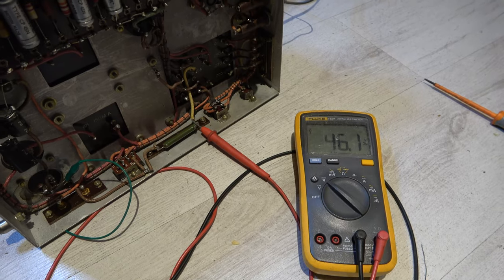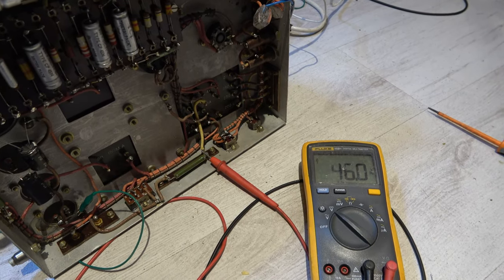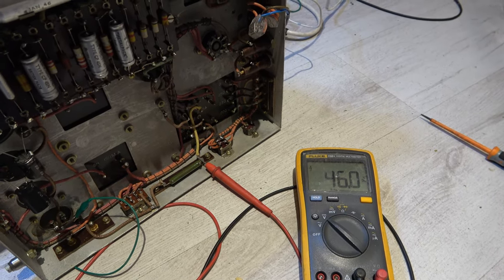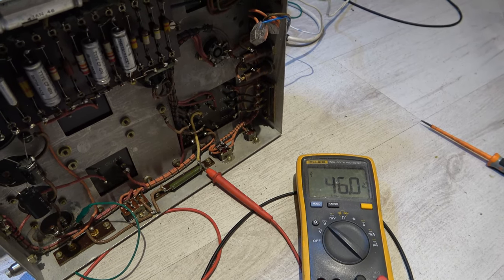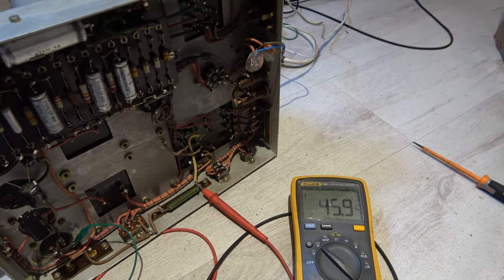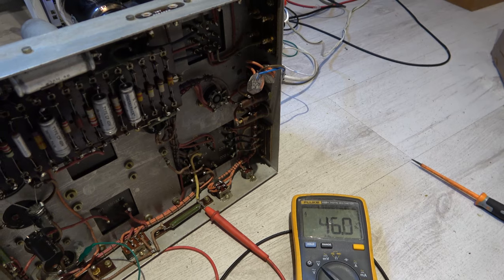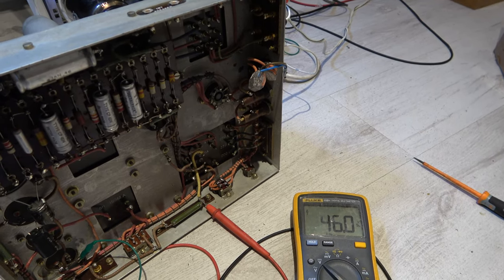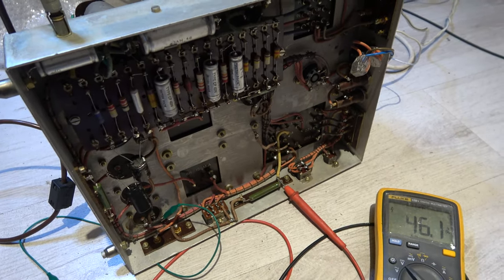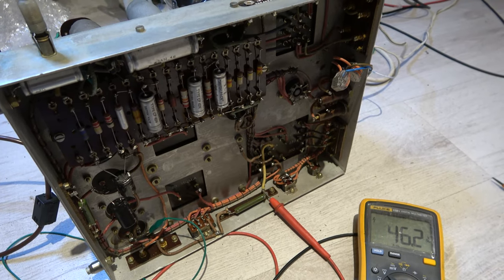So I just thought it's worth doing some testing on the amp while it's running. I've just measured across R47, a bias resistor for the PX4s - it's running at 46 volts, which I think is about right for this amp. And I think the anode voltage on the PX4s is about 344 volts. According to posts I've put up on radio forums about the PX4s, that seems pretty ballpark - so that's kind of encouraging. Still getting this very low frequency hum which I don't know why. I've changed out a lot of capacitors and basically everything, so I'm a bit worried it's like one of the chokes here or something, because it's making a slight vibrating noise. I have earthed the chassis as well and it seems okay. Still investigating.